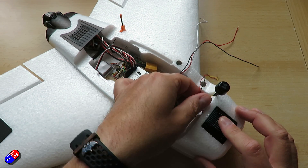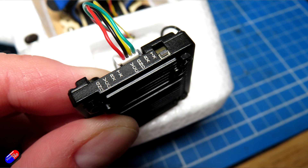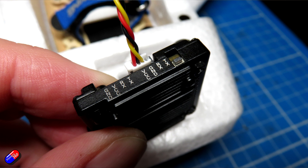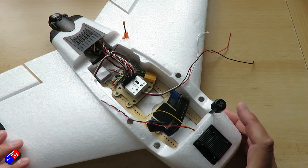The on-screen display is actually created in the goggles. Normally there are four cables that come out the back of something like the avatar unit: ground, voltage, transmit, and receive. We don't need the transmit pin — we only need three wires — so that makes it a little bit simpler. Let me zoom in a little bit closer and talk about what I'm going to do to wire this all together.